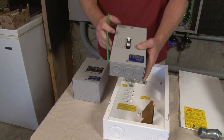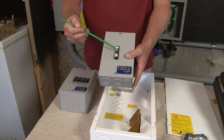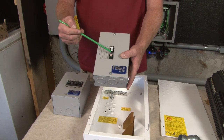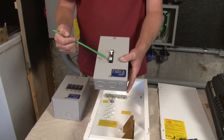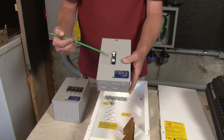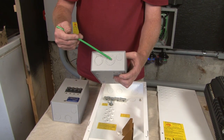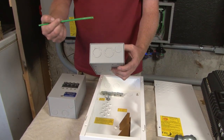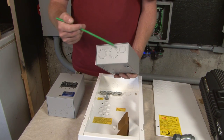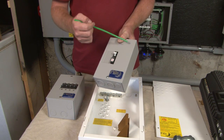The Big Baby Box has four locations for DIN rail breakers. Our DIN rail breakers at 150 volt up to 63 amp take one spot; our 300-volt breakers take two spots; our 80 amp and 100 amp DIN rails take two spots. So depending on the configuration, this box can hold up to four positions — if you're using two 80 amp DIN rail breakers it holds two; if you're using 63 amp 150-volt breakers it can hold four. This box has the industry standard knockout locations and is ETL listed. On the inside it has a grounding lug and mounting locations for a long terminal bus bar.